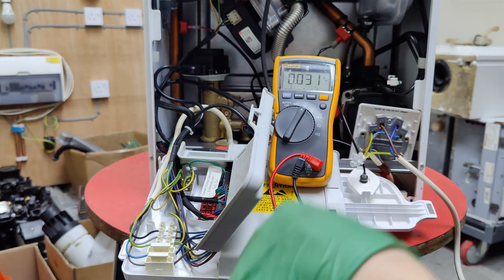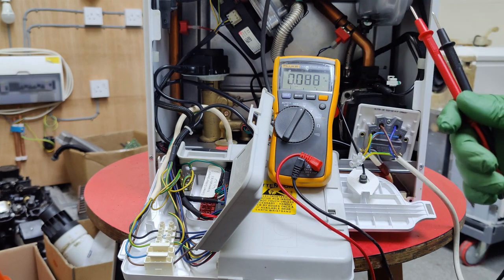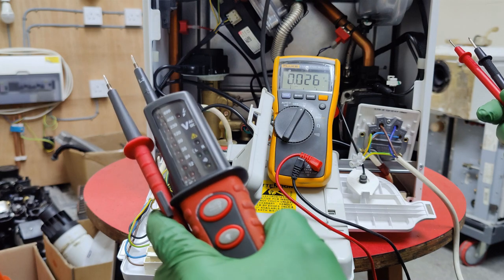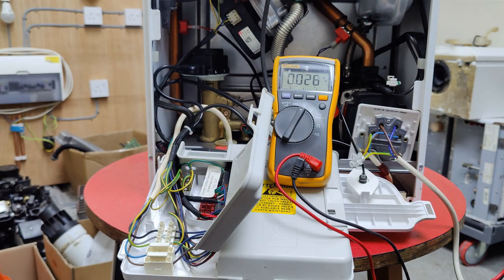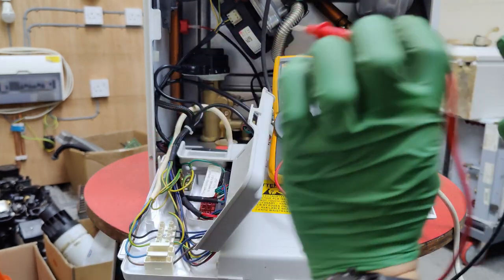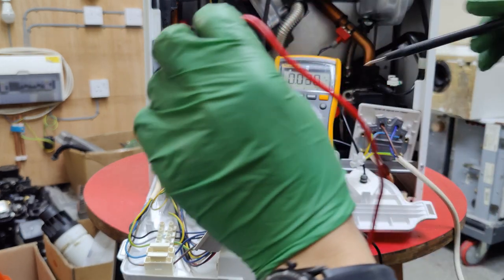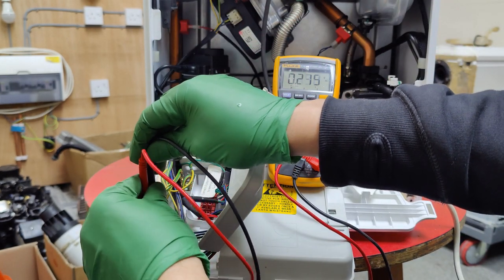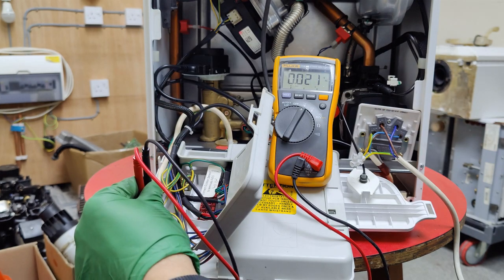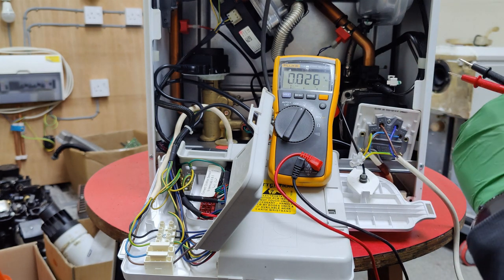There are various ways you can check it. We have our multimeter ready — you can also use these types of voltage detectors depending on what you normally use. Let's check the boiler first. The fuse bar is on, you've had a visual look and everything looks okay. We're going to check between live and neutral at the boiler itself, and as you can see there's no voltage there.